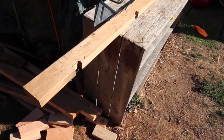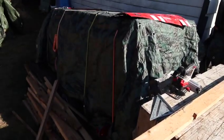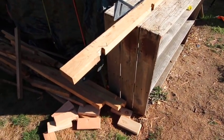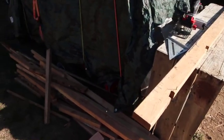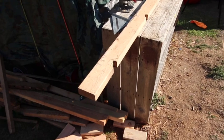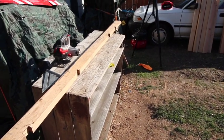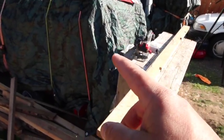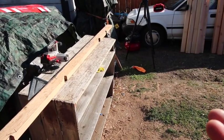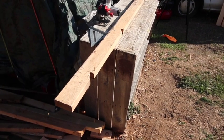I am replacing it with T1-11 style siding. I was going to do a board and batten cedar — which is actually what's under this tarp here — but if I go that route I have to get an engineered stamp in my state and county. So we're gonna use those beautiful pieces of cedar for other projects down the road. I'm just gonna get rough-sawn plywood to do the siding and then use the battens from the board and batten I got so it looks like board and batten. With structural plywood T1-11 type they don't make me get an engineering stamp.